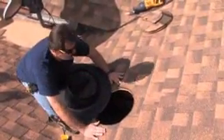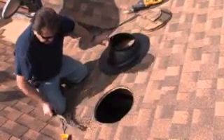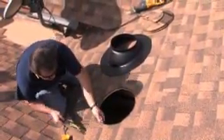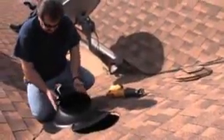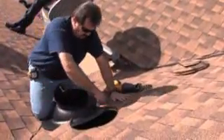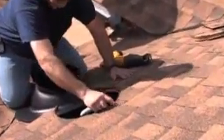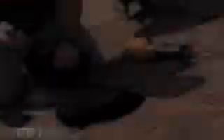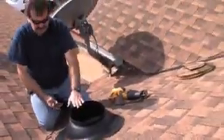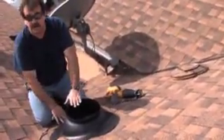We've got to take the flashing out and stick it under the shingles. So we're going to lift the shingles gently so we don't ruin them, then try to stick the flashing under the shingles. We have to come around and trim the shingles back about an inch to an inch and a half. What I have here is a hook knife, which is great for cutting shingles. Set the flashing down — we want the highest point of the flashing to be on the bottom.